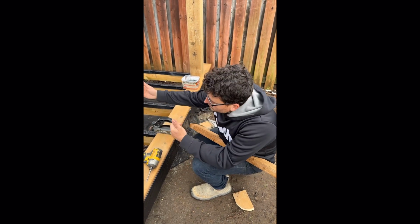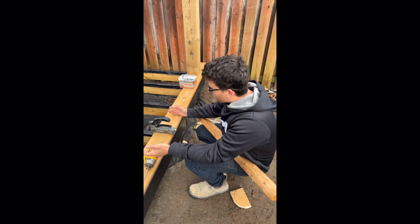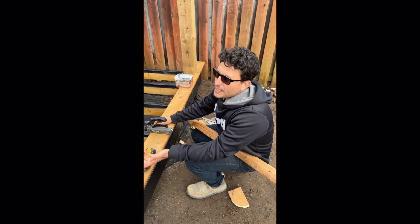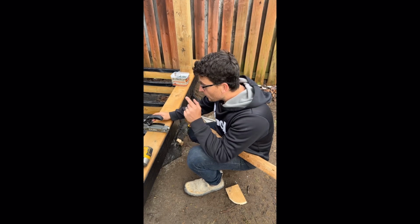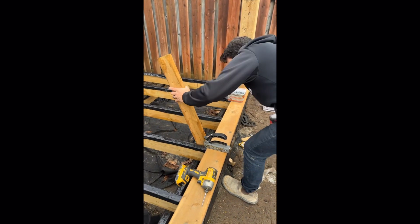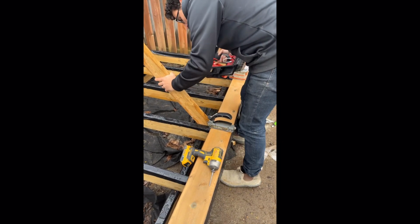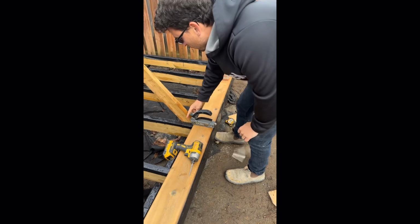We'd do that, but we'd pierce the joist tape, so that would be kind of stupid. Or where's your cam lever or your bow wrench? I'm at my house on a weekend and all my stuff is on site. So we're gonna do this the old school way. We grab a piece of wood, 2x4, put it in a bit of an angle, pop a nail in it. Maybe two for good measure. Get your board ready to screw.